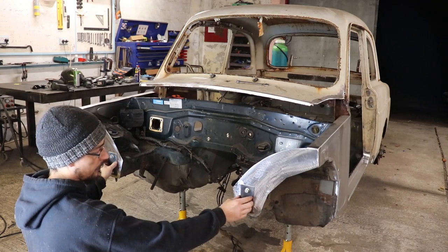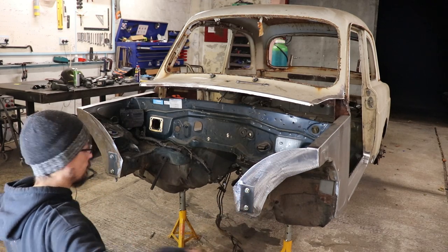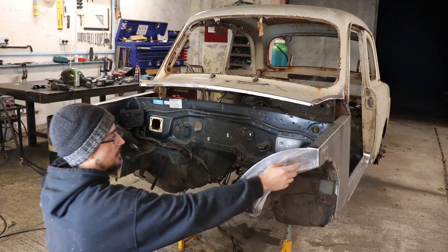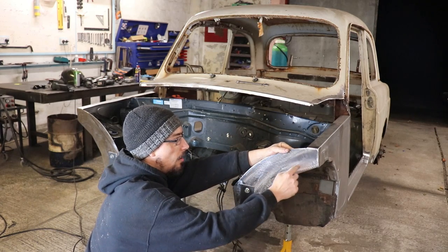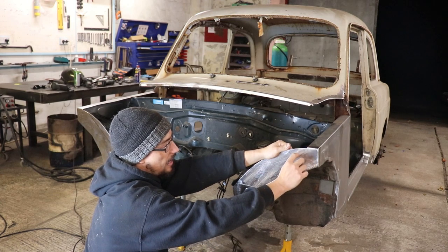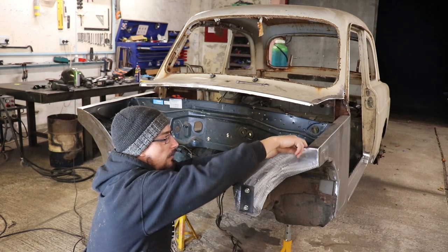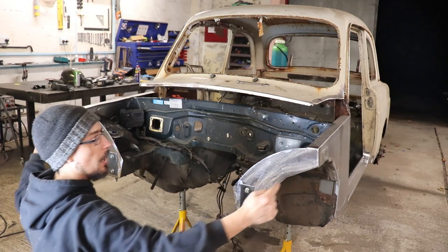So this is going to have two bars which will come straight out, and then some tube wrapping around which will tuck inside the fiberglass panels at the front. And then what I'll probably do is drill a hole in this where the roll cage is going to come through, and then actually extend the roll cage tube out of this panel. And then I can just weld it around the outside of this rather than trying to get in the back, and then have a smaller wraparound bar.